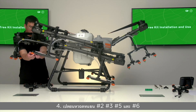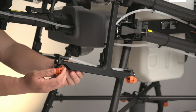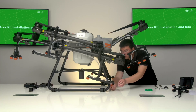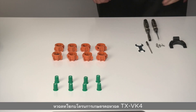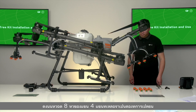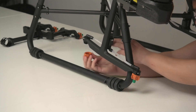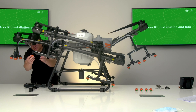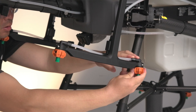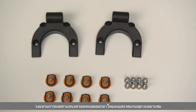Installation Step 4: Replace the nozzles on arms number 2, 3, 5, and 6. The nozzles used on the fruit tree drone are TX VK4 nozzles, so the 8 nozzles of the remaining four arms also need to be replaced. Clean and dry the removed nozzles and nozzle locating rings and store them properly.